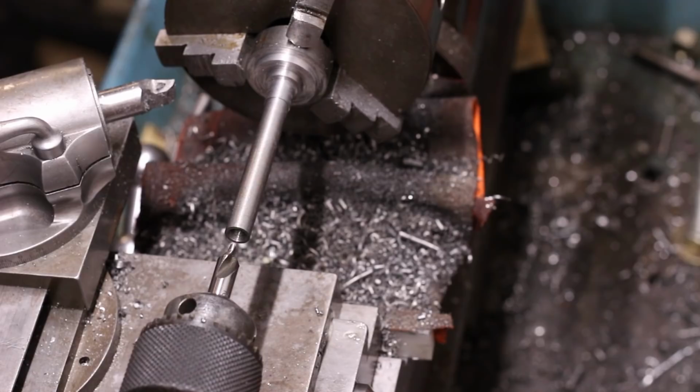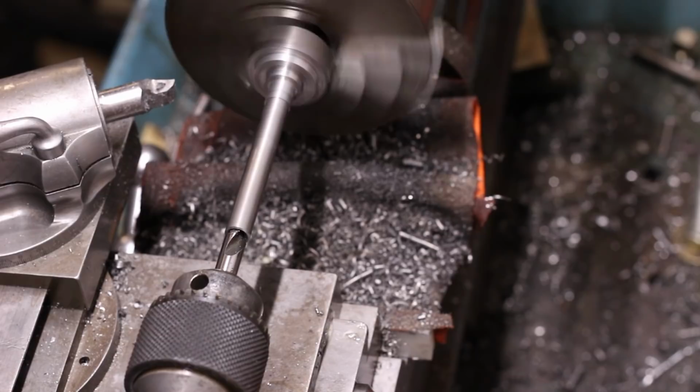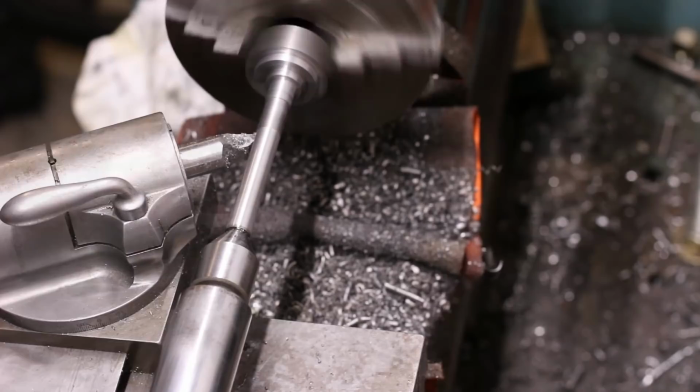After tapping, the chamfer was cleaned up with a center drill to ensure the center was not thrown off by burrs raised from the thread tapping. Finish turning with the tailstock center in place presented a challenge, not only with tool clearance, but also with such a thin wall section of the tube.